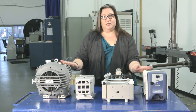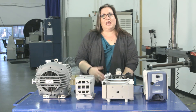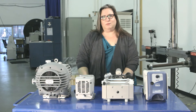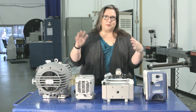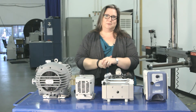With any of these pumps, it's wise to run them a few minutes before you start purging so that they're nice and warm. And then after you're done purging, close the vacuum valve on your oven and let them run and idle for at least 30 minutes. This keeps the pump warm and helps it purge out any sticky residue that might have gotten in there before it solidifies and causes problems.